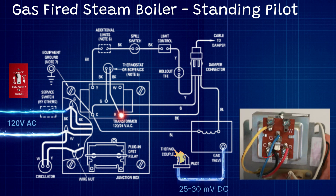This is a terminal bus that has different lettered terminals on it. Some of these terminals mean something a little different than what you would see in an AC system or a furnace, and we'll go through that. You can see this little glowing ball of light — that is the 24 volts on our transformer where our low voltage control begins.